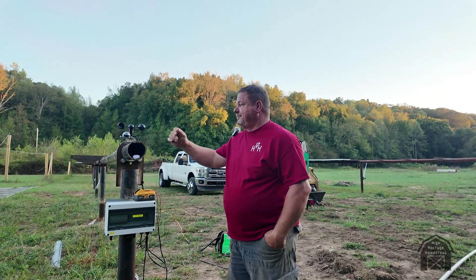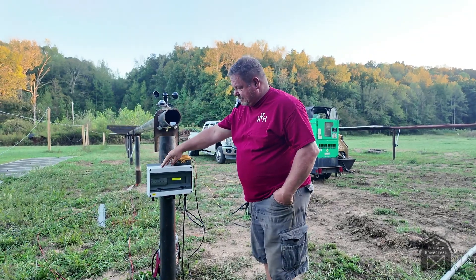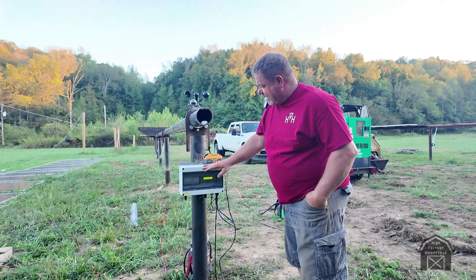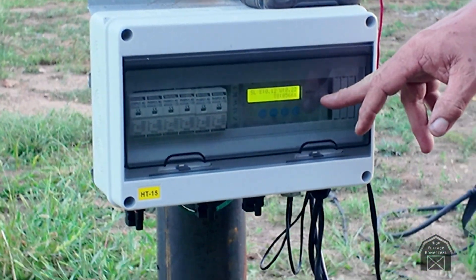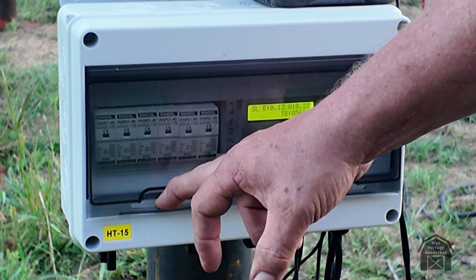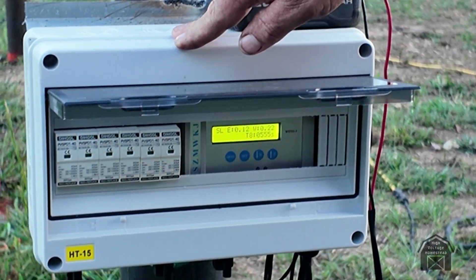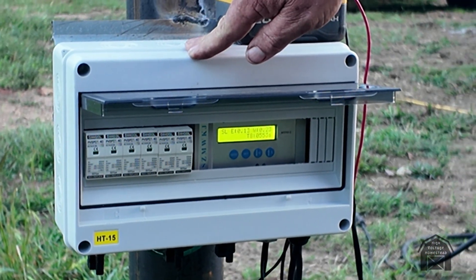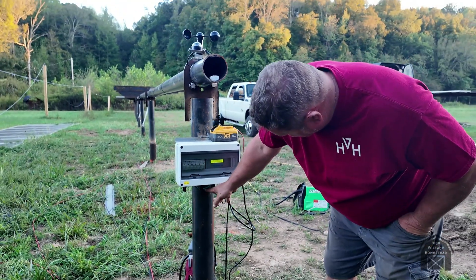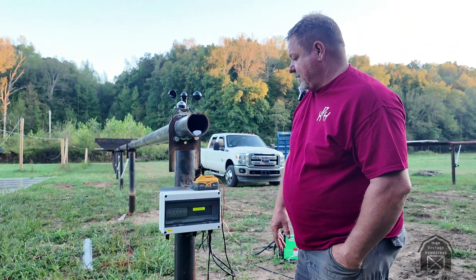Little update on the recent one here. Yesterday I put the surge protectors and the mounting in, and I found out that the solar controller actually has a DIN mount and it fits in the little box, which is pretty handy. So I'm going to go back on the other one and mount it in there — you can still see the display and all the buttons. I drilled holes and put some connectors on the bottom to tie the solar panels into.